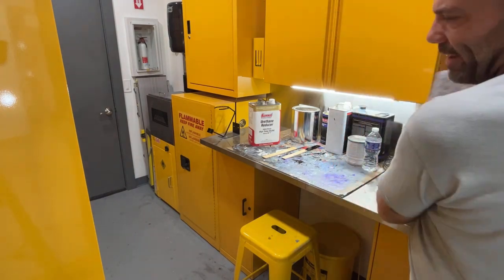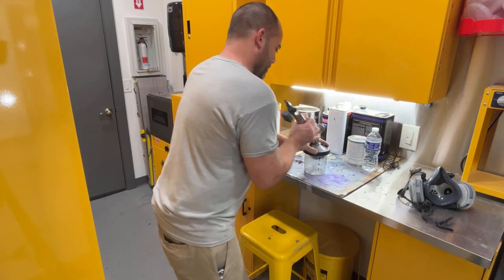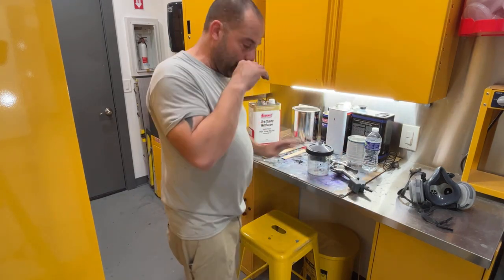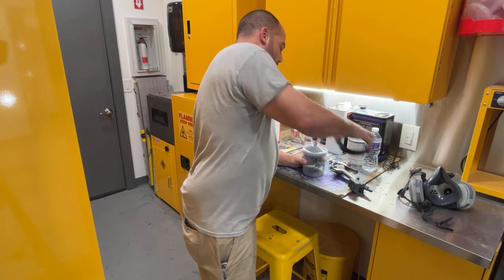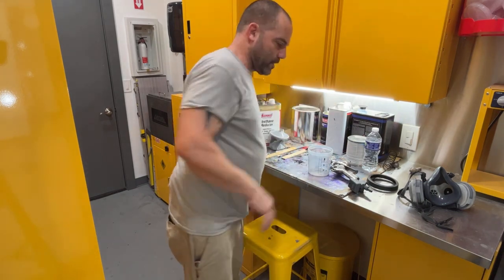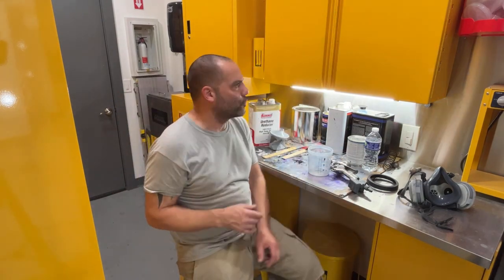As you can see at the end there, I just made it with the sealer. It was just about empty, but we made it good enough. Put a good coat on all of that because that's really going to try to lock in that cast iron from hopefully not rusting for a while. Unfortunately, cast iron does tend to rust, especially when the benches sit outside. That bench is from Florida, and I think it's going back to Florida, I'm not sure.